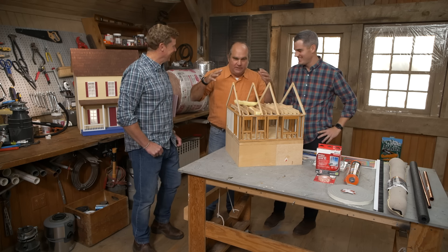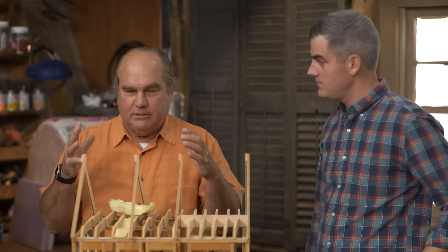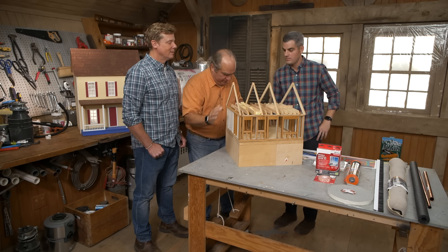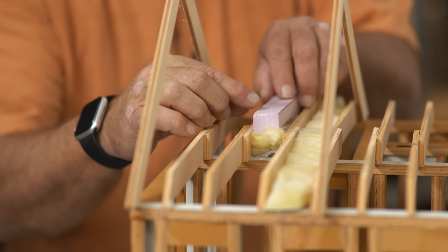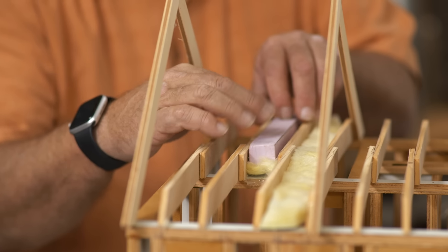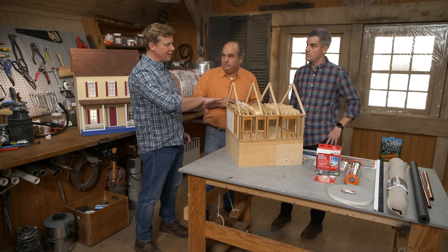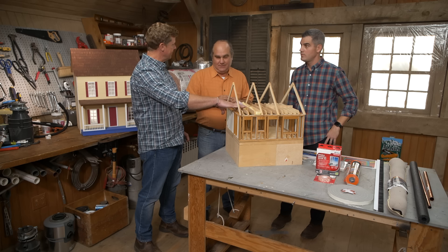It starts with an inspection. Get up to the top of the attic stairs and look inside and just say: if this was a boat upside down in the water, would this house sink? So it means close inspection to insulate really well. There are all kinds of tools nowadays — there's rigid foam that you could cut to fit in between the joists, even on top of the fiberglass insulation so you could still put a deck there. They also make bubble pack insulation. You can't insulate enough. It is okay to insulate the floor of the attic because that serves as the effective top of the house.